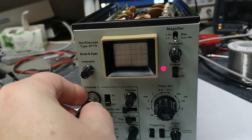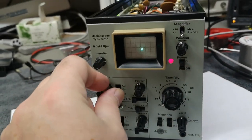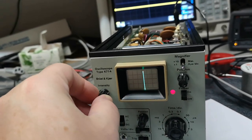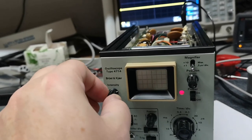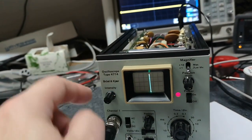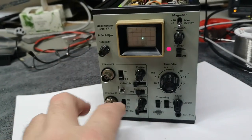There's no response on anything involving the sweep, but the sweep is somehow acting on the blanking signal. So we've got multiple errors in this unit. I don't want to burn a hole in the middle of the screen so I move the beam quickly. Intensity works as well. Channel one seems to have some connection issues. And we've got no signals on channel two — I would assume this is always a two-channel scope.